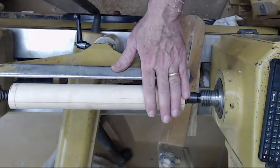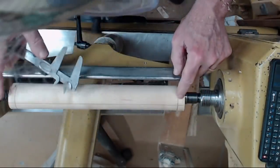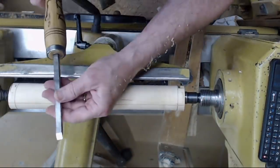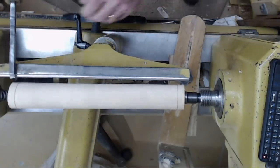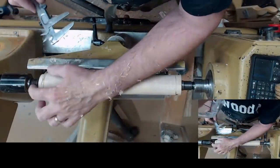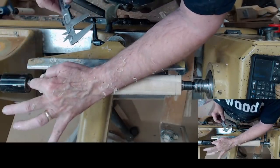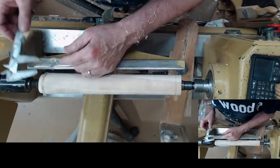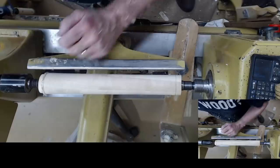Now we're going to take this down to three-quarters of an inch for the tenon. I'm going to use a beading and parting tool because that's the easiest way to make a tenon — a wider parting tool makes it a little easier. Get the speed up a little bit. This is between centers — the safest way to turn. We're going to take a peeling cut. I've got a revolving ring reference here that's close to three-quarters, so once I get down to that size I can start being more careful — it gives a quick ready reference.